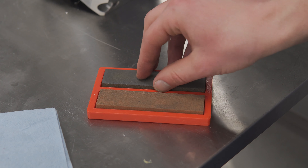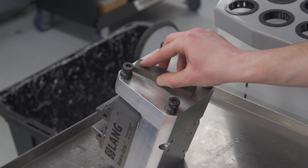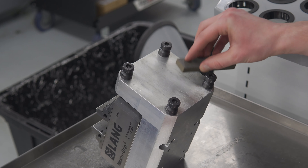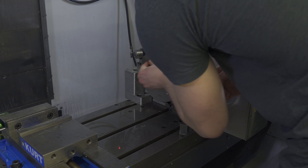It's important to use flat stones on precision surfaces so you don't accidentally clamp it on a high spot on the surface. With the coolant we're running, I notice some staining under places where things have been mounted like a vise or on a laying plate. The easiest way to take care of this is just with some WD-40 and some Scotch-Brite. I'll stone that surface as well.